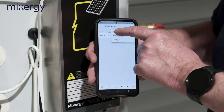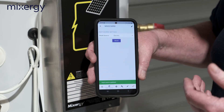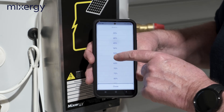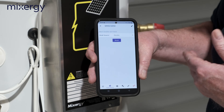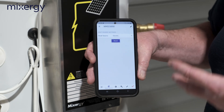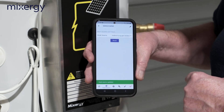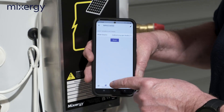We can also change to 'electric' to check the immersion heater — for backup in case the boiler plays up. Hit boost, set it to say 60%, and it confirms it's boosting. Check the gauge and check the immersion heater comes on. Once happy, finally set it to what the customer will actually be using — in this case, 'indirect' — and the heat source is confirmed updated.